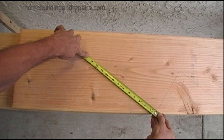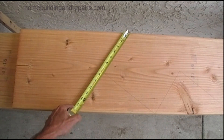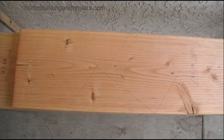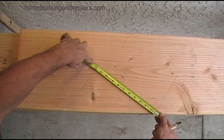Double check it again. You can check it that way — it gives you an idea how thick it would be going up against, especially if you're going to use a ledger. Always good to check it there and get a measurement. If you have nine inches, use a two by ten.